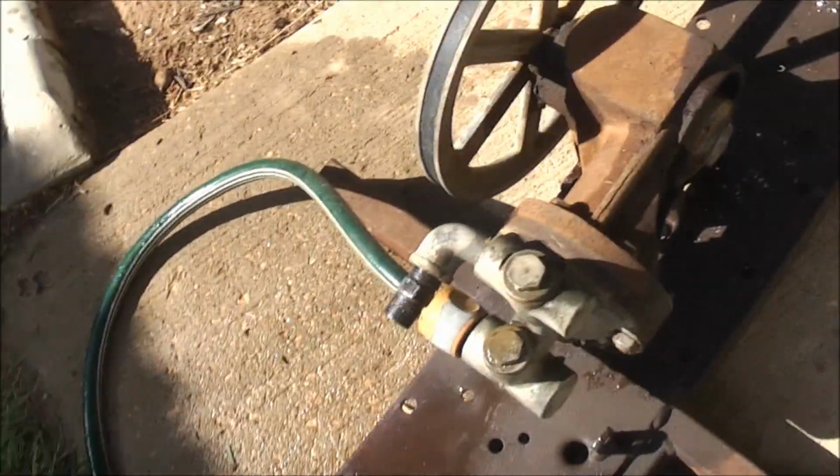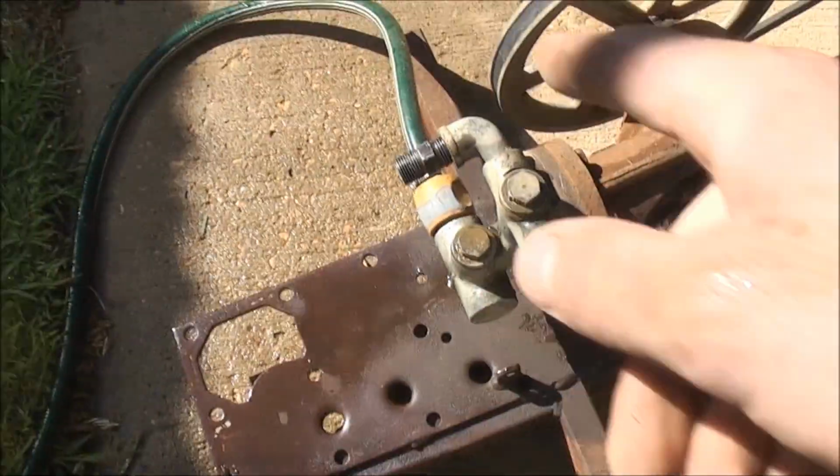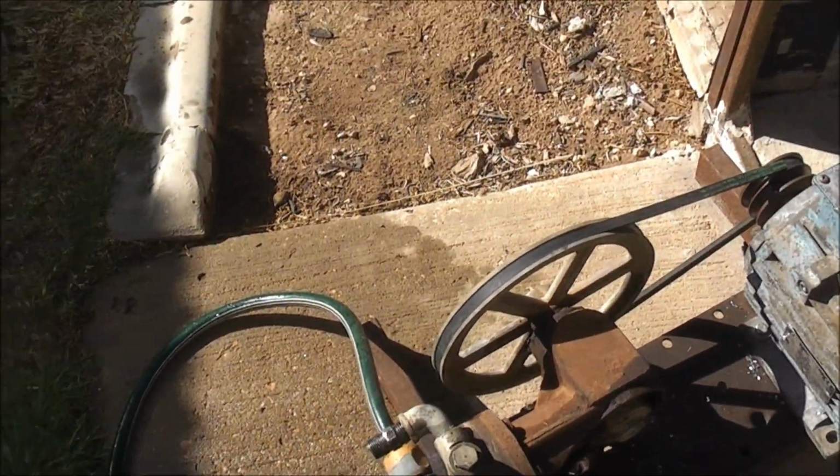This is just becoming quite useful for little things. Hydrostatic pressure tests would be great for that. I could even come up with a pressure washer lance, something like that. This is a similar principle, but a pressure washer just moves quicker, with three pistons instead of a diaphragm that actually hits the water hard, and the swash plate mechanism in there, having three of them, has a consistent flow. So it's not like this one where it's intermittent flow.